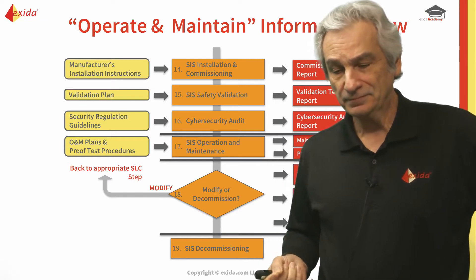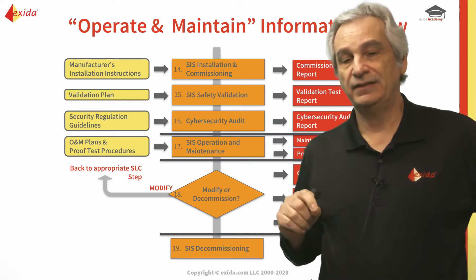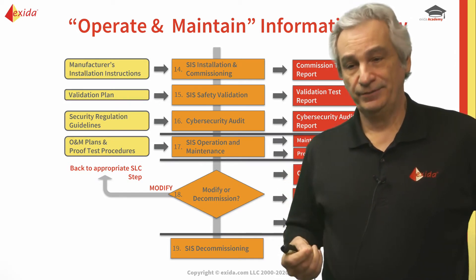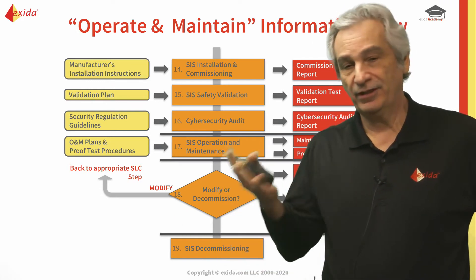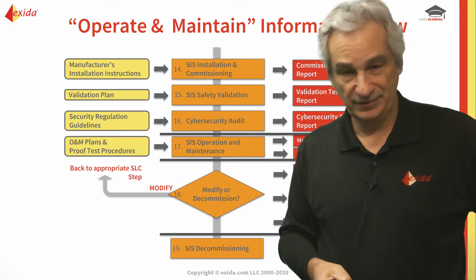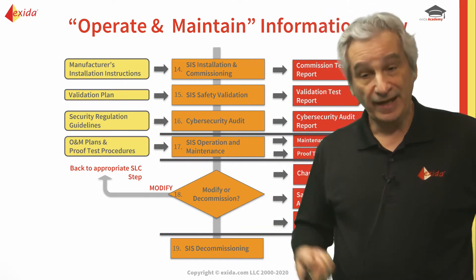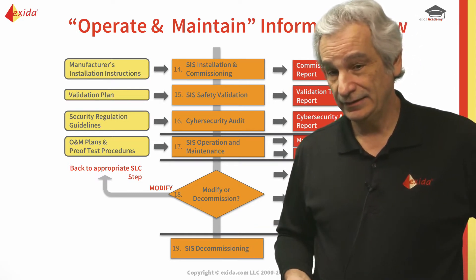You can imagine that was squeaky body time — they were all running around trying to figure out what was wrong. What they found was a software error: the driver they'd written for the ethernet chips on the controllers wasn't clearing the stack properly when it overflowed. So when the network was bombarded, it kept overflowing, the software wasn't dealing with it, eventually it timed out, and the controller went to its shutdown state. Because the same software was in both controllers, they both did the same thing.